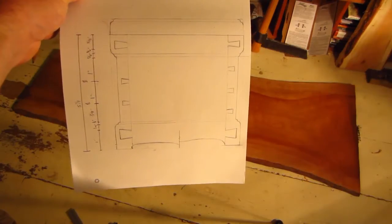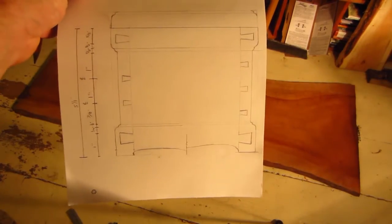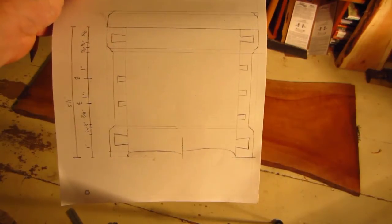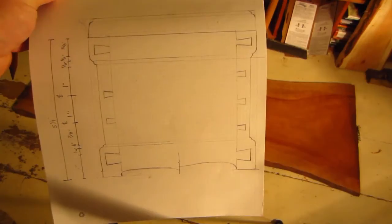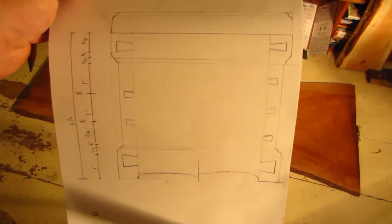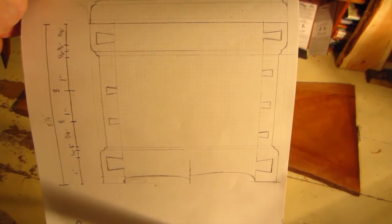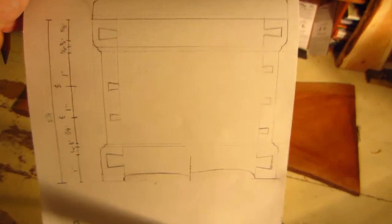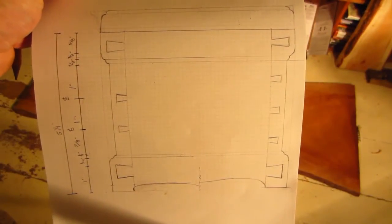This is the design I'm going to be going for, looking at it from one side. The box will be roughly five and a quarter by five and a quarter by 14 inches long, plus the lid for an added three quarters of an inch thick. I plan on milling molding out of this with hand planes — plowing it out, smoothing it out, and then using a couple hollows to get those fillets there. And I guess we'll see how it goes.